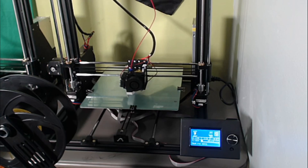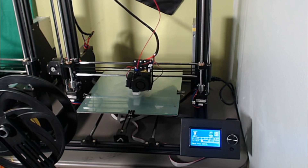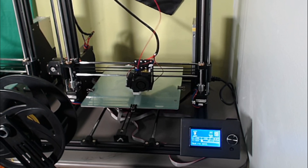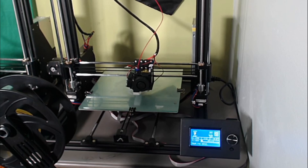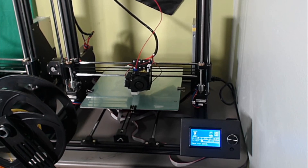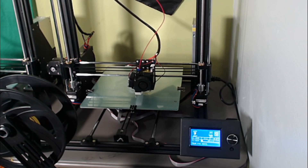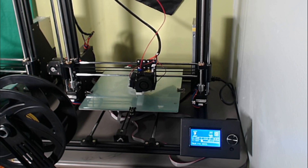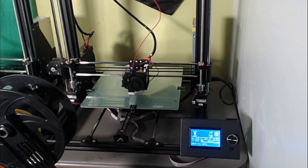Things are getting more interesting - you can see the print head moving a lot more back and forth as it advances. There are a lot of tiny little circles and intricate details, so it's important that adhesion is spread across the full surface when printing something that doesn't have a raft or a completely flat bottom. This model has intricate holes in it, so you want full coverage of the entire glass bed to get those corners to stick down.